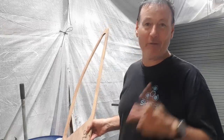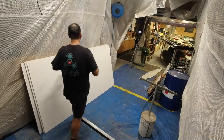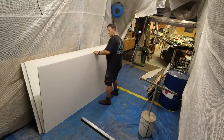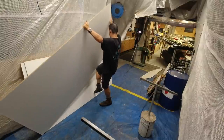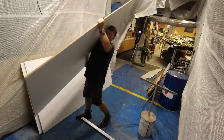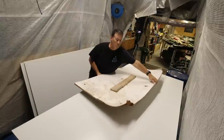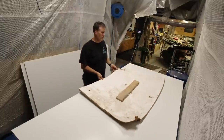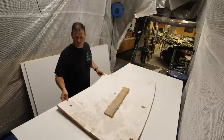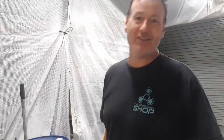I've just tested the template up on the deck and they are symmetrical. I've just ordered and received four sheets of 12mm MDF with a melamine side on it, and that's really critical — I need the melamine side to make sure I can physically release it from the mould. If it was chipboard or some other composite wood, there's a good chance I'd have trouble getting it off. I'm going to wax it, route it, do all the stuff to get the window inserts done. It's probably a good day's work just doing all these cutouts, but once done I'll whack them on the moulds, get back to polishing, waxing, release waxing, sealer glazing, and then the final wax before gel coat day on Saturday.